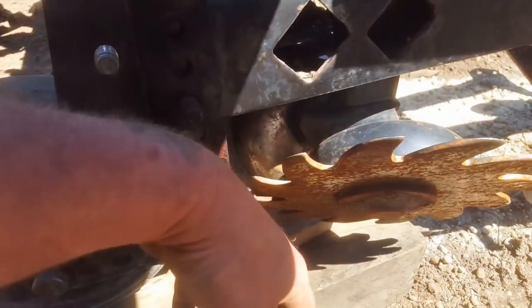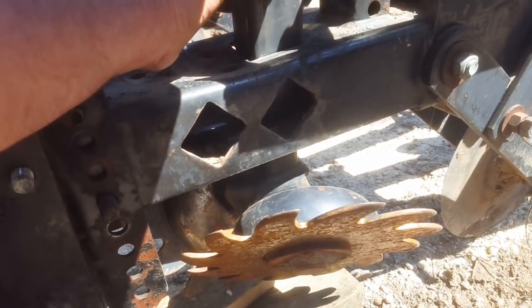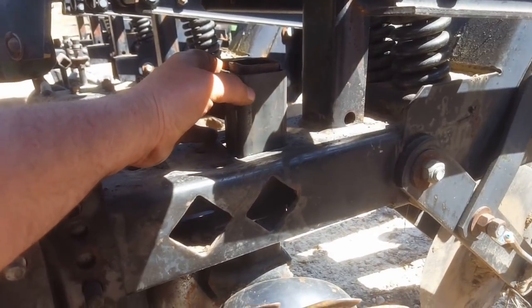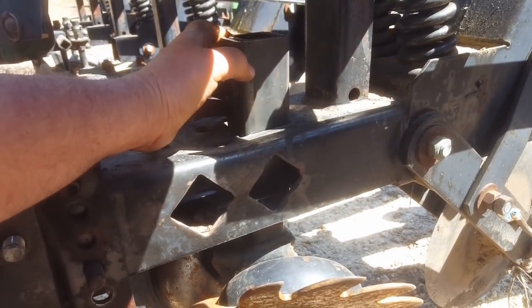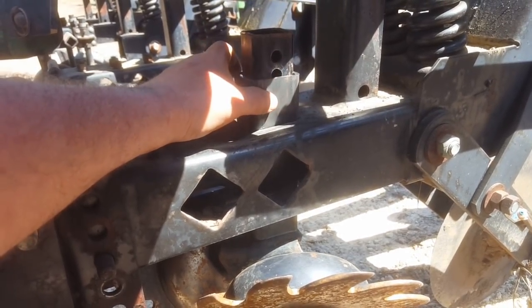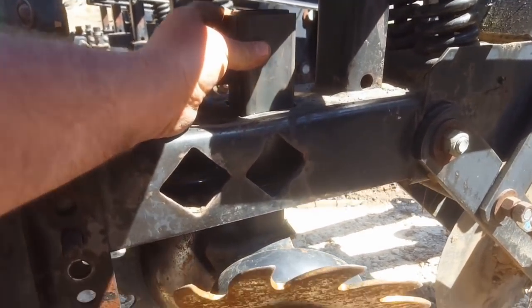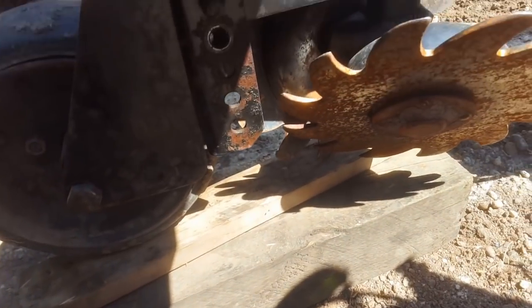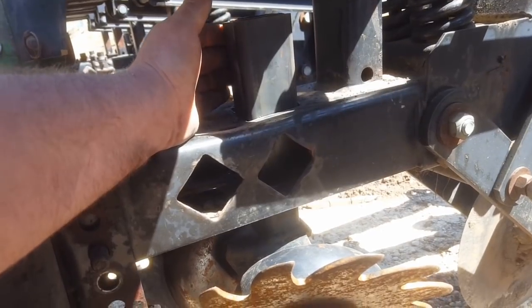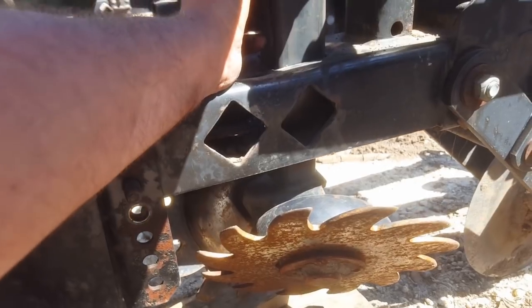And then the trash whip, I just popped a hole up top here, and that tube will sit like that, and then you'll have a hole at 1 inch, 2 inch, and 3 inch. So this tube is on 3/4 inch spacing holes, and this tube will be on 1 inch spacing holes, and that gives you your 1/4 inch adjustment. But I got it sitting on a block, so it's pretty darn close where it needs to be for depth. And that tube looks good right there. A simple weld around the top and a little bit of tack welding in the bottom.